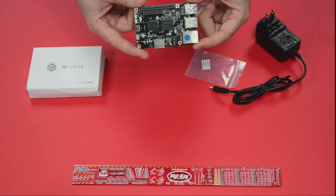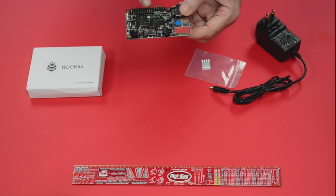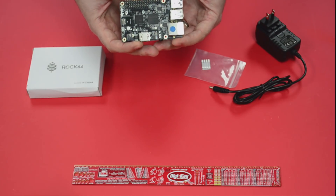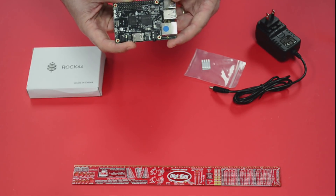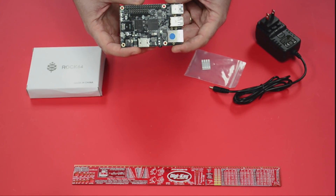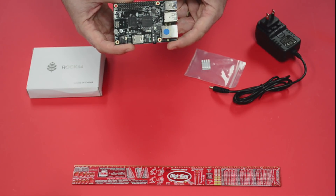This has got a four-core processor — the ARM Cortex-A53 64-bit processor. This one comes in three different models that all look pretty much the same: a one gig model on par memory-wise with the Raspberry Pi 3B+, a two gig model on par with something like an XU4, and a four gigabyte model. It's DDR3 1600MHz RAM.